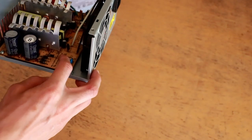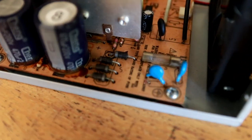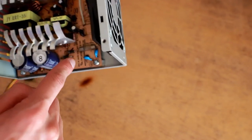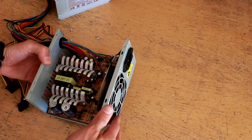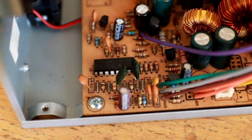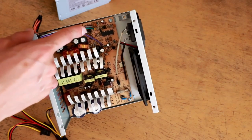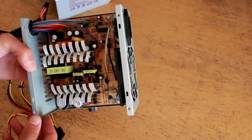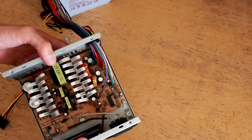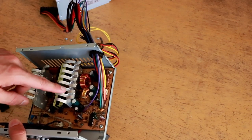There's a bridge rectifier for rectifying the mains. It is fused, though it's certainly not an HRC fuse — it's a regular little glass fuse. I might take this board off and have a closer look. That'll be the watchdog chip, which is what I'll be looking into modding in the future — I'd like to have a switch to bypass the watchdog so I can subject this to higher surge current without worrying about tripping its overload. Other than that it looks like a fairly standard switched-mode power supply. The only thing I'm really disappointed in is the width of the aluminum on the heat sinks.